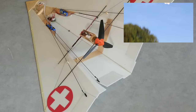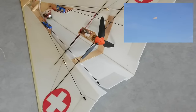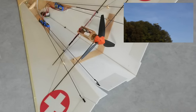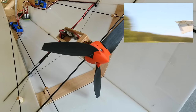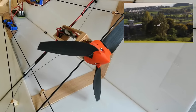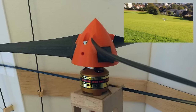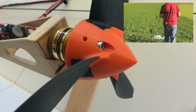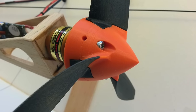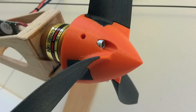As a first test I used a regular brushless motor for testing the 3D printed propeller. This version has three blades, 9 inch diameter and 4 inch pitch. It draws 12 amps from a 3S LiPo. The flight performance with this configuration is excellent. The 3D printed motor however will turn much faster with a 3S LiPo, which means it will draw much more than 12 amps.